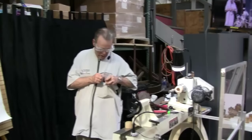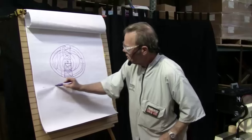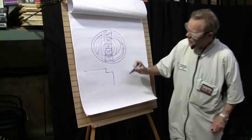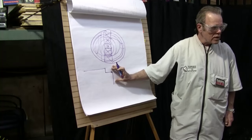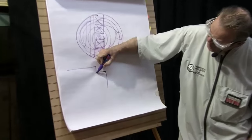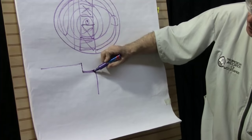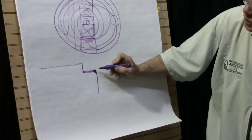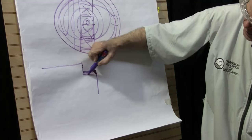The other trick, and I don't know if I can draw a picture. This will be the first time I've drawn this picture, so I might not get it right. So we've got us a tenon. And it's just the top half of it. First thing we're going to do is bevel this a little bit. Then we're going to trial fit to see if it's close. And if it doesn't even begin to slip on here, what that means is we can come down here and get this thing square all the way out to where that corner was. You follow me? And then we do it again, and we put another little bevel on it and trial fit it, see if it'll start slipping over. If it does, you notice how far it goes, and that's how you know how far you need to bring it down. If it still doesn't fit, you get to come all the way down here and do it again.